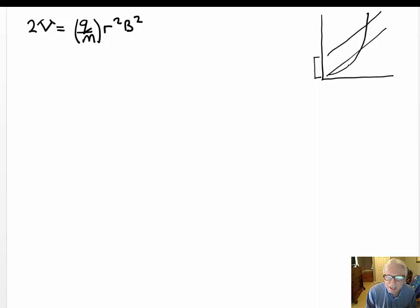And if it is a straight line and it goes through the origin, showing that over a range of values, I can turn around and say the answer that I'm looking for is this over this range of values. So it's much more sophisticated than plugging numbers in. If I plug numbers into an equation and I have a DC offset, I won't know. I'll get the wrong answer, completely the wrong answer. And I won't be able to say anything other than I think the answer is this under these very specific conditions, and I'm not even sure my equation is behaving properly. It's a very, very naive kind of analysis.